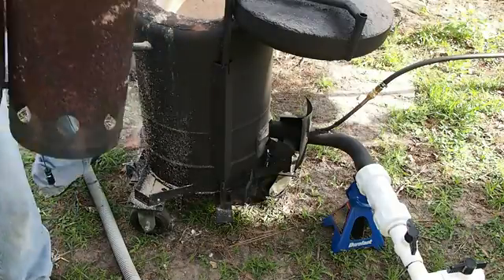I like to get that going — get those coals nice and hot before I turn on the oil. You can see there's a swirl effect going on inside of there; you can kind of see some of the embers swirling around. What happens is eventually it heats up and air will start to come out of this hole here and it will hit that plate, preheating the oil in order to get it up closer to the flash point. I'm going to take the lid and put the lid on properly. I'm actually going to go ahead and drop this crucible here — it's just a clay pot lined with fire clay mixed with sand — and put that on top of the pin before I get it all started.